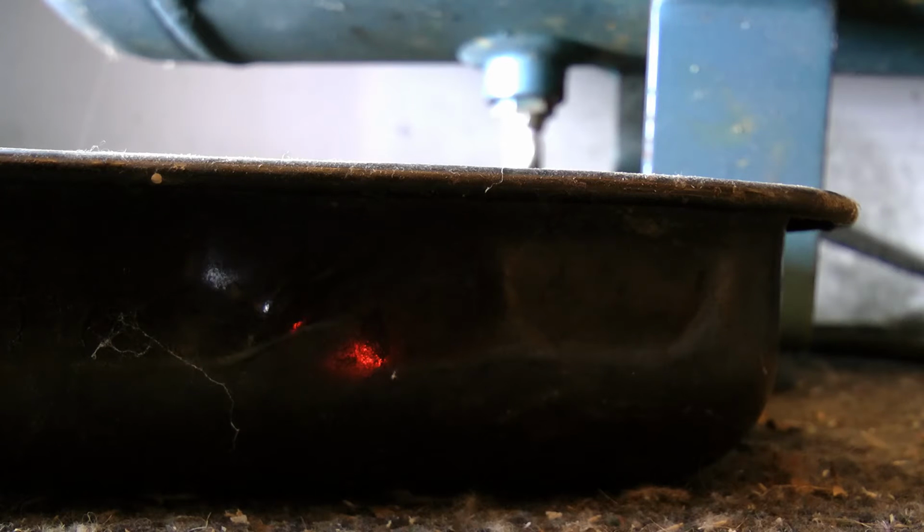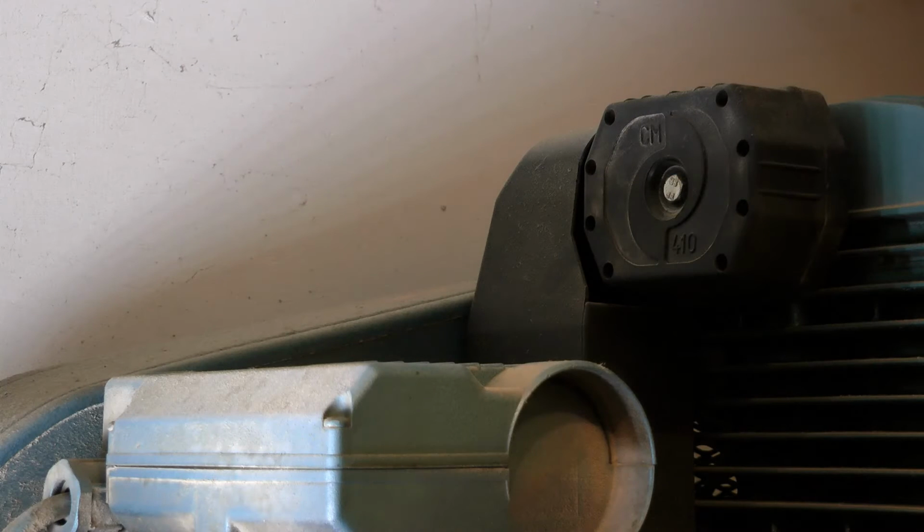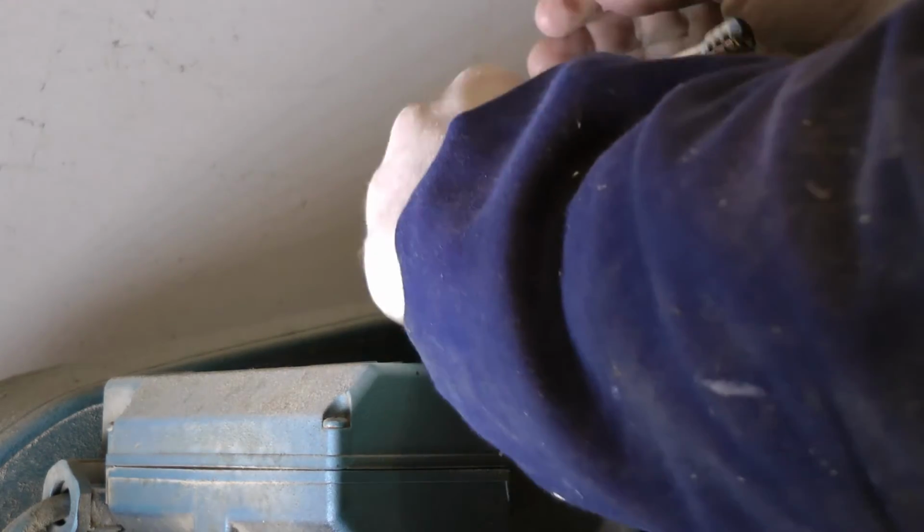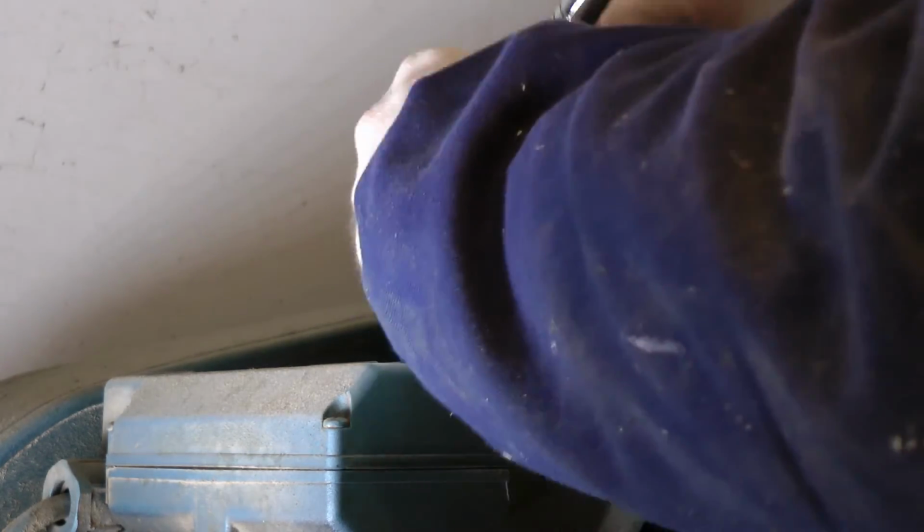Now we'll go on to job two. Right, now you can see the air filter. I'm going to take it off with the 10mm socket, this bolt here. And let's see what we've got in here. I recommend you make sure you've got a bit of air in your tank, so you can switch the compressor off and still blow the air filter out, because you don't want it running when you're blowing any dirt out.